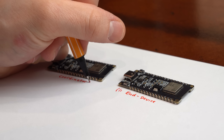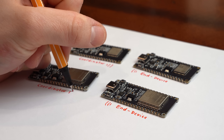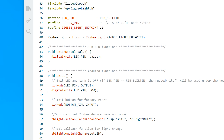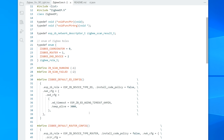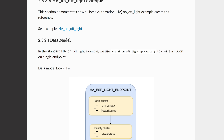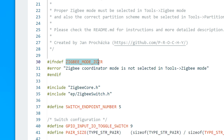For testing we need to program one board to become the coordinator and one to become an end device. I want to do that for both pairs to see if there is a big difference between the boards. Luckily the ESP32 core already comes with Zigbee examples, and if we look at the on-off light example this all seems pretty easy to understand. The complicated Zigbee stuff is managed in a deeper-lying header file, and you do need to be a bit experienced with coding to make something like this on your own. The ESP32 documentation can also help. The on-off light example is for the end devices and the on-off switch example is for the coordinator devices.